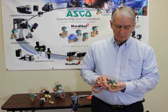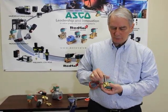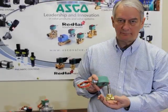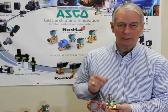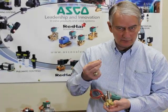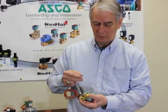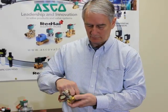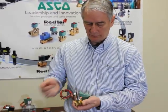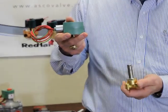Another thing you need to remember when you go to install the valve: if you choose to take the coil off for the installation, be sure to keep all of the parts. There will be a spring that goes under the valve — you need to hang on to that, as it needs to be there to keep tension on the coil when it goes into place. On the Red Hat 2 valves, the coil and the housing are all in one molded piece.